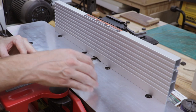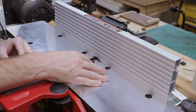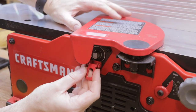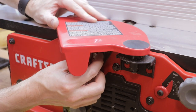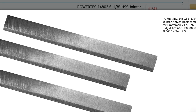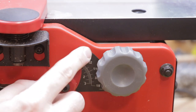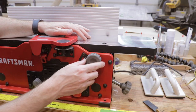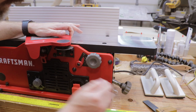With the tool unplugged — the tool does come with two cutter blades, and I do not believe these blades can be sharpened. There are four allen bolts that lock those into place. There's also a locking mechanism for when you want to change the blades, so the cutter head is not trying to spin when you're changing them out. Replacement blades are available and I'll put a link in the description. You do have some adjustability in the depth of cut, from essentially zero up to one eighth of an inch. To adjust, you just loosen the lock knob and turn the knob at the bottom.